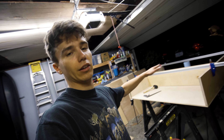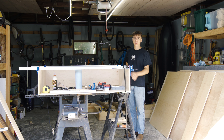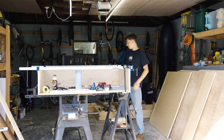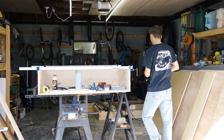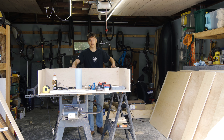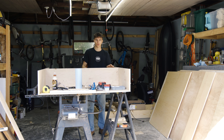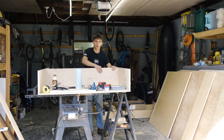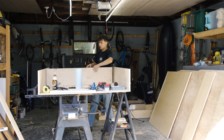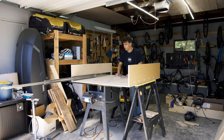Stuff is clamped down right now — I went ahead and attached the other side. I put the back piece just in the center temporarily so I could use the clamps to squeeze it together and make sure everything is perfectly 90 degrees. I'll remove it once the glue dries. That's probably going to be it for today — a pretty productive day and it's starting to come together. Tomorrow or later this week I'll drill pocket holes in the back and center pieces and put those together, which will pretty much complete the frame.